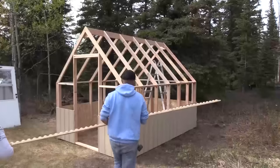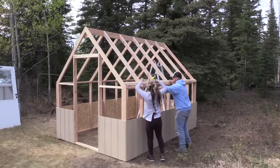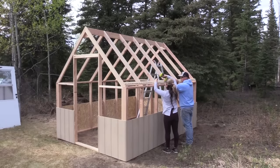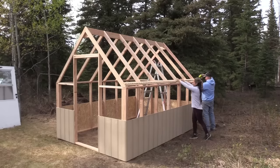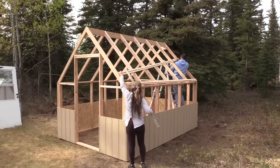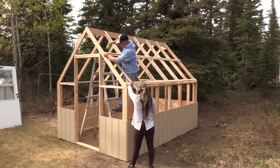You should definitely bring that last purlin all the way down so there's no gap between the eave wall and the purlin — that'll make it airtight with the wavy strip on it. See how easy that is? We just take the purlin, which already has the wavy strips on it, set it on top and screw it down. We don't have to go back and add the wavy strips on top. You do want to make sure the wavy strips are all in alignment between the different purlins so when you put the corrugated material up, it all still works out.